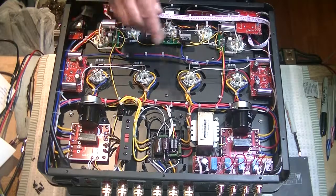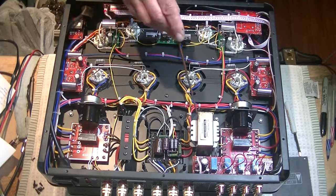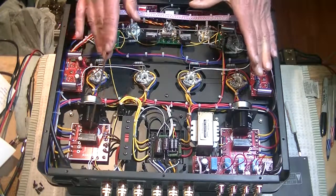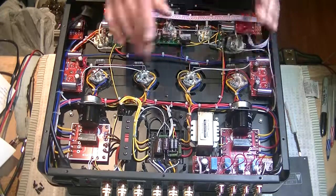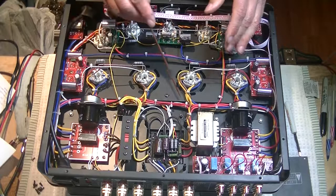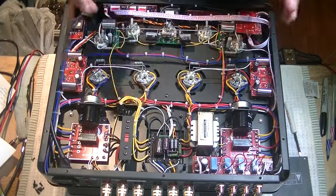So we have to clean up a really raw DC signal, and for that we use a choke. We have a filter choke here of 4 Henrys, which is actually fairly small, or low in value. But there's a school of thought that says that the higher Henry you have, the higher the filtering you have, but also the more resistance you have. So it's a balancing act, and some audiophiles claim that the lower value chokes actually give a better sound.